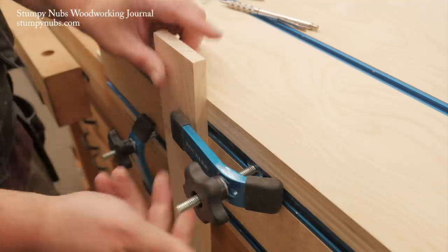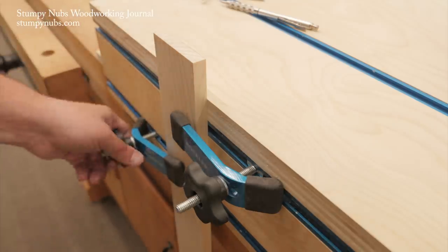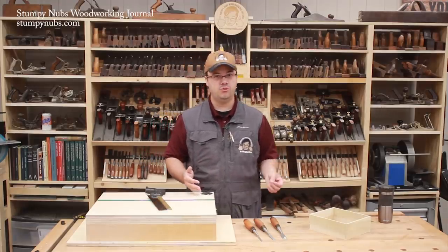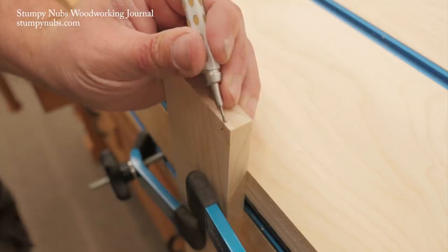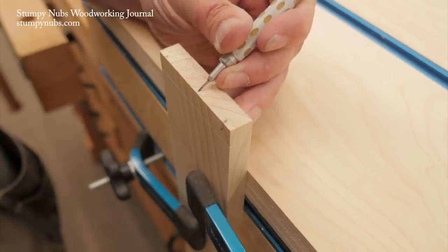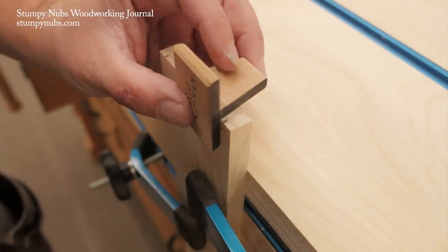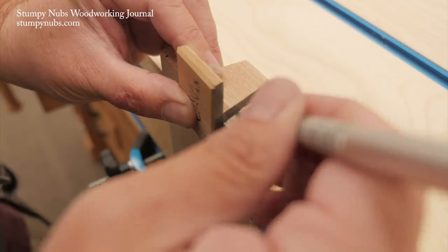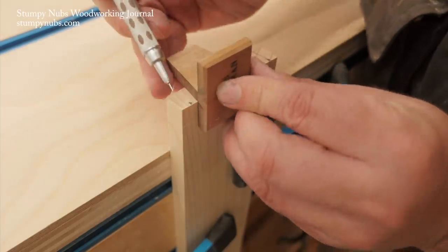Now I get to lay out my joint. A pins board is secured to the front of the workstation with the labeled inside face turned away from me. Joint layout is a matter of personal preference, and while you can use special tools to achieve even spacing, a shallow drawer such as this can be laid out by eye. I simply place marks about a quarter inch from each corner, then I eyeball the center and place a pair of marks there about an eighth of an inch apart. These angles are mostly arbitrary — just do what looks good to you. They don't even all have to be precisely the same.